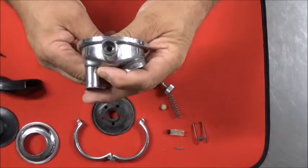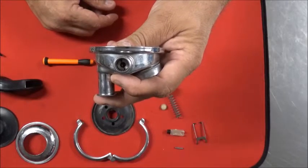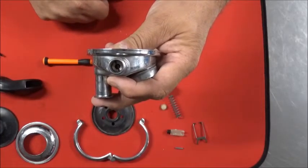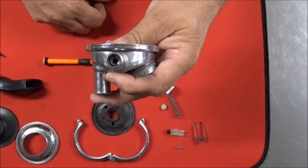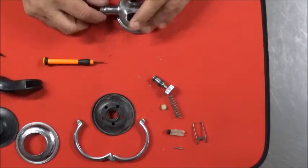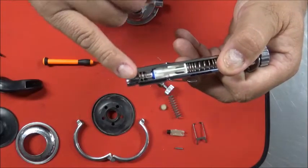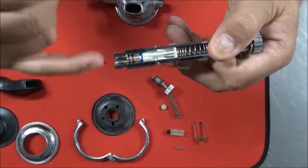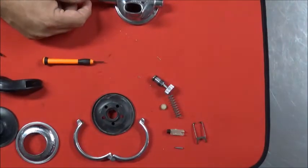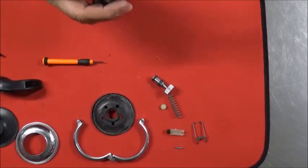Now, your Volcano Orifice, which you can see the slotted head in here, a lot of times there's heavy corrosion in there, and you want to be sure that whatever screwdriver you use to remove this, that it fits the slot head correctly and it engages it solidly, because it's chrome-plated brass and it's easy to twist those out of there, or deform them where they're hard to take out. Now, let me refer back to the cutaway. As you're removing that, unscrewing it, it's going to stop at some point, and you're going to feel like you're just turning over and over. That's because the O-ring that's on there is still holding it tight in there, and we'll need to take something plastic or brass to push it out. But I'll go ahead and take this one out so you can see.